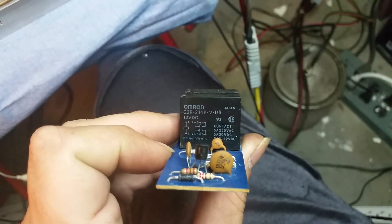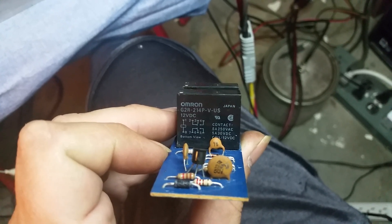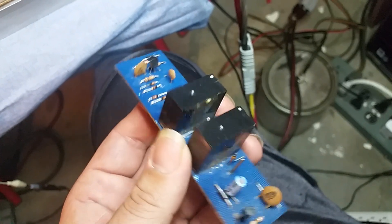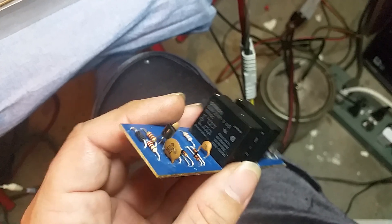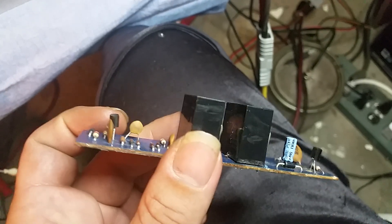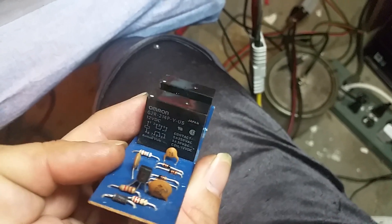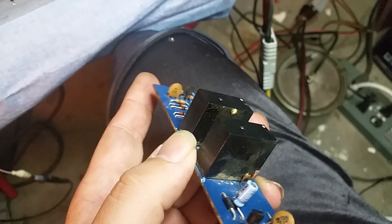I'm a big fan of Messenger amps. Now, these right here are your normal five amp double pole double throw relays. There are mathematical calculations you can do on how much RF power these can handle through their contacts, because we're dealing with RF power — high voltage, low amperage, high voltage RF.